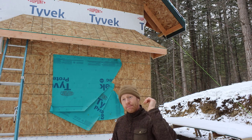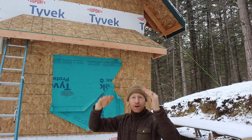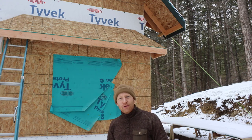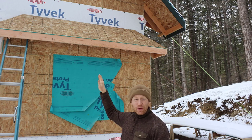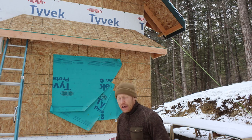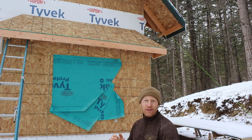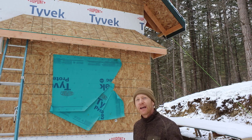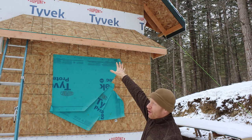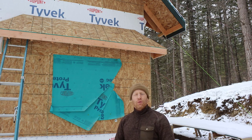We'll slide our hips on, put our roofing metal on there, then our caps and hip caps. Finally, we'll do another row of flashing that goes over the tops of the roof panels at the intersection where the roof panel meets the wall. We're actually going to do a bread-pan fold — I've got some cool Stubai brand tools out of Austria for that. We'll bread-pan the tops of our sheet metal as it abuts the wall. That way, if water can get past our Z-closures, trim, flashing, and counter-flashing, it's got five different layers to get through before it can cause a leak. Over that, we'll put additional Tyvek to lap over everything so that water drips out correctly.